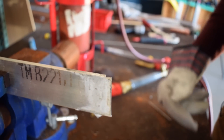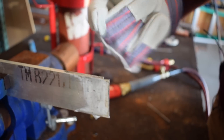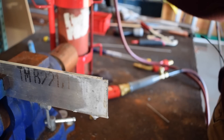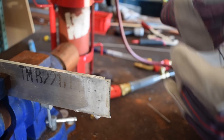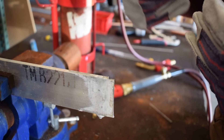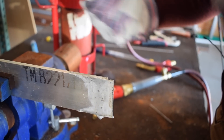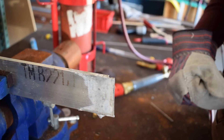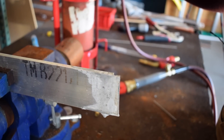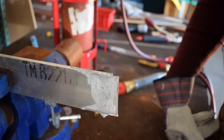I applied a pretty ridiculous amount of material just to try to draw as much in as I possibly could to the inside of this. I'm going to let it sit a little bit and then thermal cycle it — which, for the strongest joints you wouldn't thermal cycle, but we're trying to demonstrate the thermal cycling we'd see in a system as it changes from higher temperature to lower temperature. We'll let this sit for two minutes or so, then I'm going to thermal cycle it into this bucket of water and we'll see how it holds up.